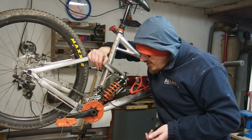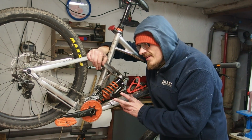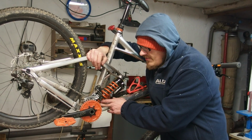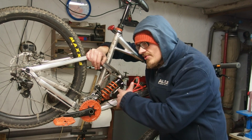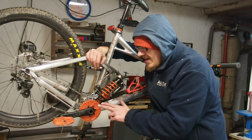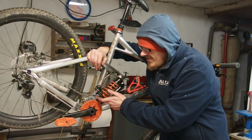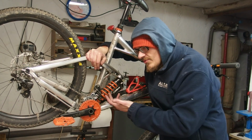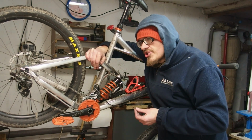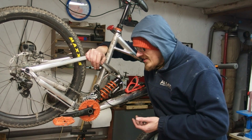But what's happening here? The problem is that this derailleur doesn't swing into the frame as much as it needs to, because my smallest ring is too much inward into the frame. And unfortunately, because this is direct mount and press fit, I have pretty much no wiggle room to get the cage of the derailleur to move inwards as much as I need, or try to find an older style narrower chainline derailleur, or try something from the road bike or something like that.